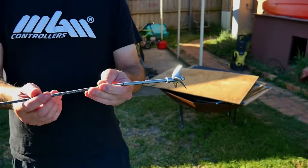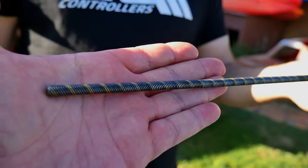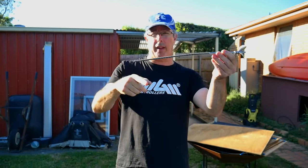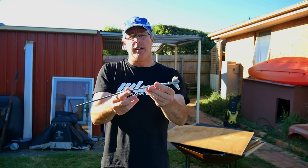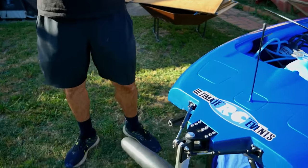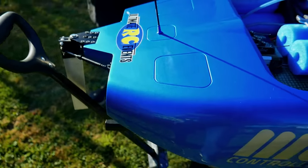So where are the props? The reason the props aren't kept in the boat is that the drive cables can suffer memory — they sit in the boat as a curve, and over time they can actually hold that curve. If you were to take them out, they'd have a curve in them, and you end up with oscillation. When you're running 40 horsepower spinning these at a stupid rate of RPM, you don't want vibration. So after every run these are taken out. The other reason is water stays in the tubes — they're not made to be water-free, they'll have water in them, which corrodes and rusts. So we take them out after every run, blow all the water out with an air hose, and blow everything out of the air tubing so we don't have any corrosion.